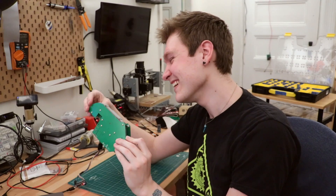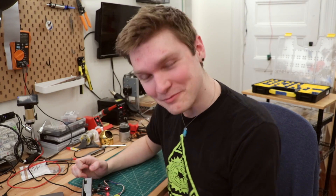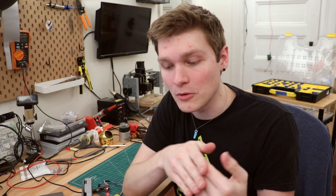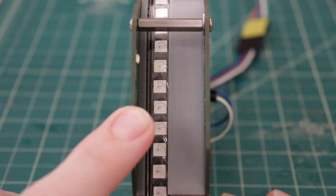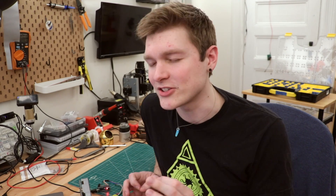It freaking works! Just happily clipping along, moving forward its little tape. From the testing I've done so far it seems pretty repeatable. The tape I've been using has little NeoPixels in it, and the length of those on the tape is two pips, so it has to go through two of the little windows on the indexing wheel to move through an entire component. I don't even have a PID loop implemented right now — this is just very naively looking for a max, a min, a max, a min, and then the threshold that I set. It does that for going through two slots, and that's all it's doing — and it's really repeatable. You can see from the footage the LEDs are moving to very close to the same position. I'm sure a PID loop will get it just that much more accurate, but it's already darn good. Using the worm gear gearbox on this N20 motor was such a good move — it makes things so much easier.